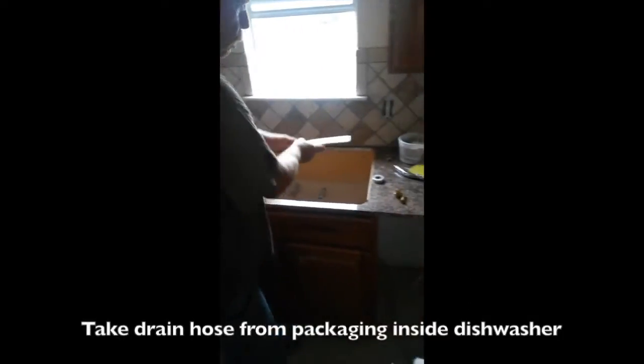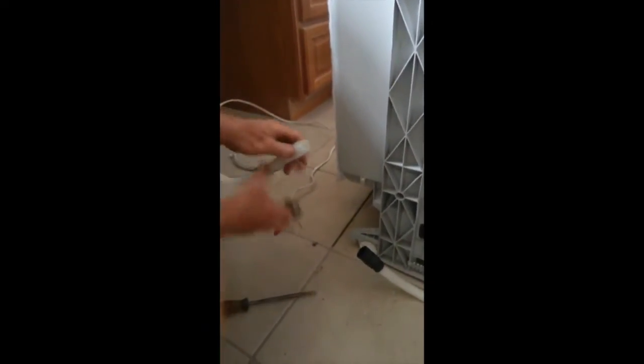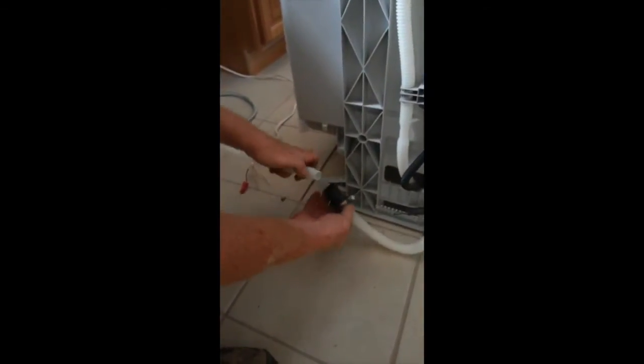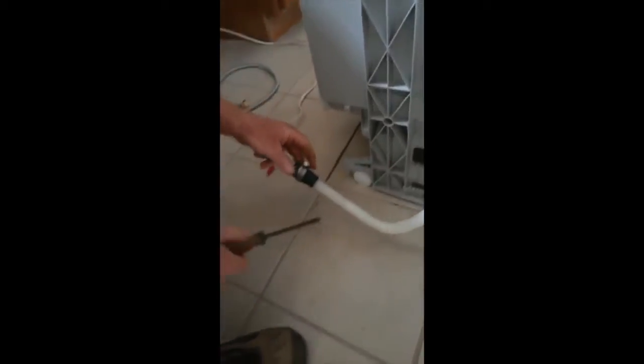Drain hose. We're going to push it through the top hole, and it's going to go down like that, okay? We're going to pull it out here. Come over on this side, team. Okay, here is the dishwasher drain hose. It's attached to the unit. It goes up and makes an air pocket so that the water won't drain unless the pump is on. Okay, I'm going to take this piece here, put a clamp on it, slide that into there. Go show how it goes up the wall there, Tim. It hooks into the sink, and I'll show you that part later.